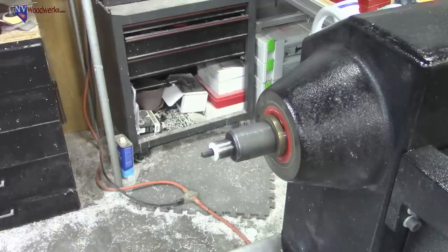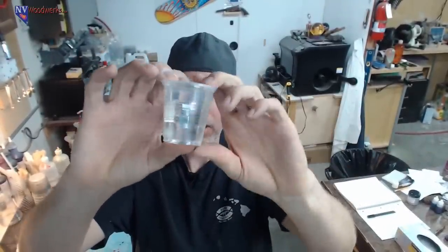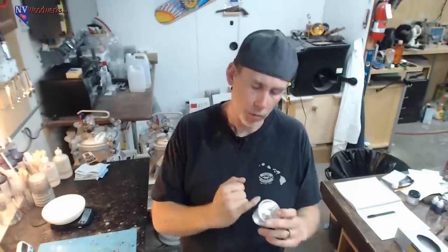The other thing that I have, like I said, is the other one, the bolt that I made. I did this at the same time that I did that one. That's Alumilite, and I'm kind of curious. I don't have time today, but I want to turn this one and see if that line is there, because this is one where, using Alumilite Clear Slow Set, I pulled it out of the pressure pot after 2 hours, poured the second layer, and then it was good to go. So we got a couple more to test. Like I said, I want to see how this works out because I haven't noticed that before in any of the ones that I've done. So we'll have to see.